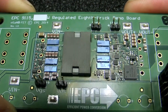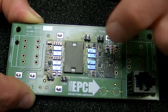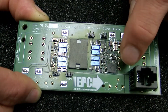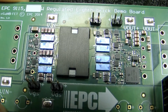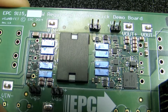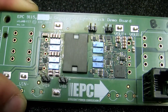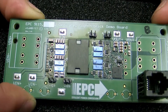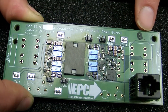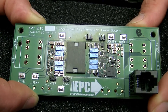If I were to try to do this with a silicon MOSFET, I would need twice the area of those FETs. And as you can see in the outline, there's no more room — you can't even fit enough transistors in the space to do it. So that's the first reason we're going with GaN. The second reason is efficiency: the GaN devices run much cooler, so I can put more power through here without heating up the board, and this is what lets me get 500 watts.